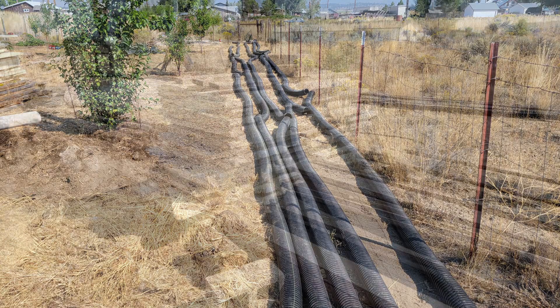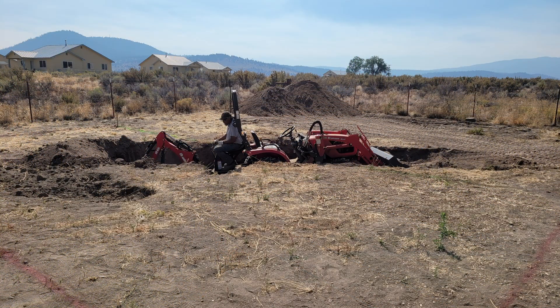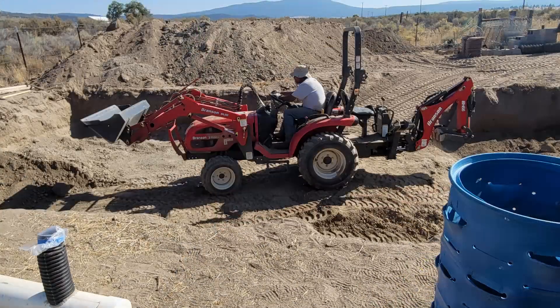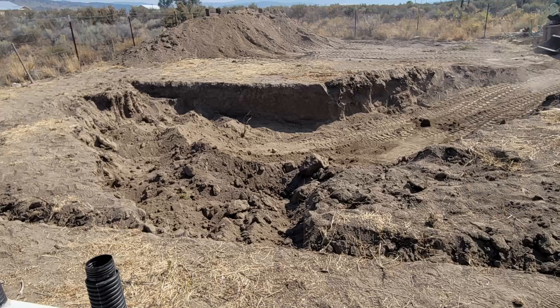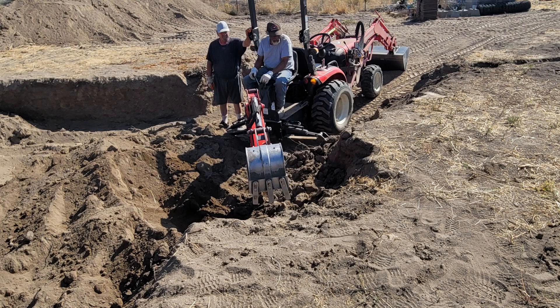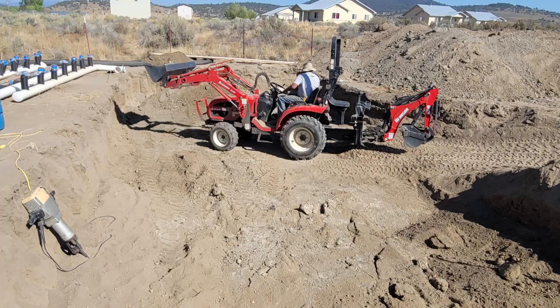The pipe was ready and the materials to build the styrofoam walls were stacked near the building site, so it was time to dig the hole. We staked out the corners, then marked out the boundaries with marking paint. We had cleared a large area about six times the size of the hole to pile the dirt, and we ended up having just enough room to store all the dirt removed. A friend let us use his small backhoe to dig the hole, and we started digging a ramp at an angle. It was fairly easy digging until we got down about three feet, and then we ran into a layer of hard pan and needed to use a jackhammer to dig down further.